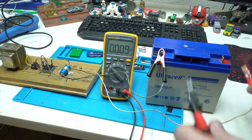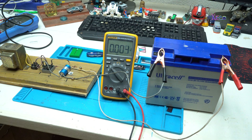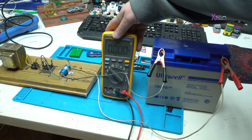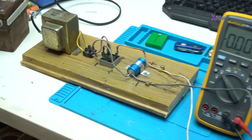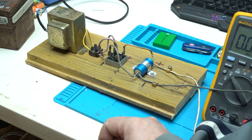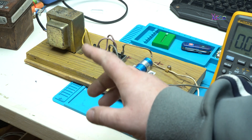It's charging and the whole system is working fine. Give a like — that was all for today's video: building a homemade 12 volt charger for car batteries, or like mine, for solar 12 volt 20 amp batteries. This setup gives 4 amps at 12 volts, but the bridge rectifier can handle up to 50 amps — don't forget that.